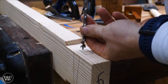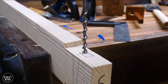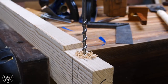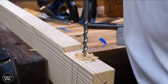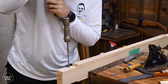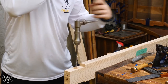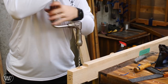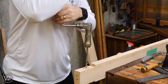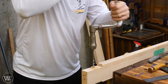You can see there I have the wide end of the wedge, and on the other end there's a smaller box for the narrow end. For the boring out, it's a fairly easy process. Drilling the hole along the straight edge is just like boring any other hole — you just want to make sure it's straight, so I'll be eyeing down it and checking from one side to the other. But when you're boring out the angled side, you have to be far more careful, so I'm actually eyeballing down it to make sure I'm running along that pencil line I drew on the side, occasionally checking it, making sure I'm vertical.